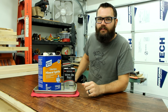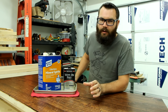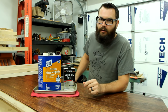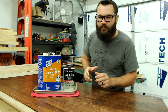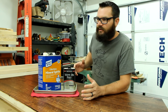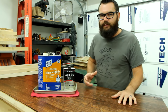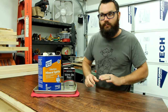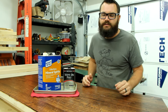I start off by mixing together mineral spirits and polyurethane. I go with about a two part mineral spirits to a one part polyurethane mix. Every now and then I'll mix it up and go about half and half equal parts. The reason I do this is primarily because when you're rubbing on the finish, the mineral spirits really kind of just helps lube it up, helps wipe it on a little bit better, and also it evaporates faster, which means that you can do more coats faster.